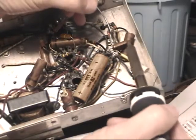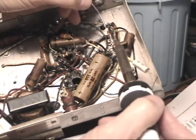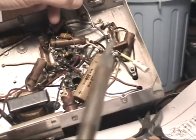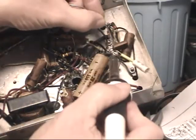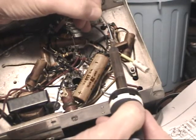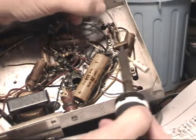What I do a lot of times is sometimes you have a hard time with transfer of heat. If you take your soldering iron and just put the sponge on it, it's nice and shiny but sometimes it doesn't want to transfer the heat that well. So what I do is I'll just put a tiny little blob on it like that.